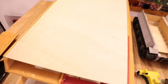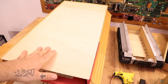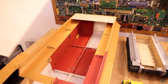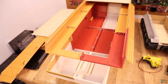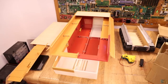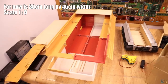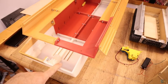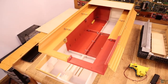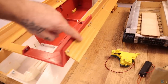This part here is not glued in place. For the top of the tank I'll use wood, because printing it in PLA would take a huge amount of time and I'd have to divide it into six pieces since my printer bed is 300 by 300mm. The rest of the tank is all 3D printed. This is version two — double the scale of version one — and the main bottom case is printed in six parts, all screwed together, with a frame and skirt also screwed and glued.